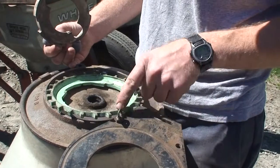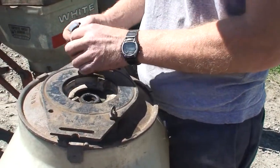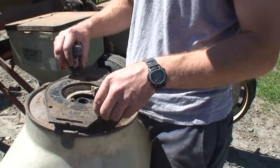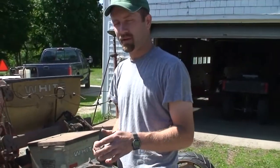We're going to use this plate here for the Jacob's Cattle beans. One thing I shared with the crew at UVM is that no matter how certain you are that the plate is the right one — even the one you used last year — you should always double-check your plate size, because seed size can change a little from year to year depending on conditions. It's always really important to beforehand take some of the seed you're actually going to plant with the plates you believe are right and try them in a driveway. You have to lower the planter all the way to the ground, raise it up just a few inches, then drive in the driveway.